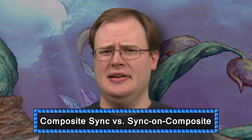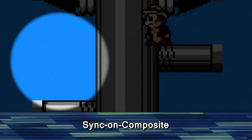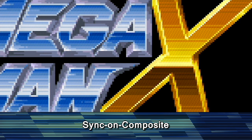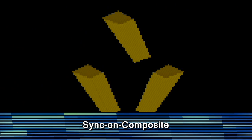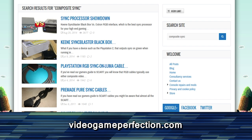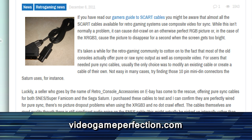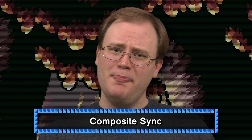So why use composite sync instead of sync on composite? Sync on composite, even though it is the SCART standard, can have artifacts introduced as the display or device receives and processes the signal. When using standard SCART cables on our equipment, we sometimes see checkerboard patterns on certain shades of various colors. Composite sync cables clean up the image quite nicely. Matt Buxton of Video Game Perfection tells us that C-Sync cables fix display issues with older XRGB scalers like the XRGB-2 or XRGB-3, but warns that a small number of SCART-equipped TVs might not accept the signal. While searching for composite sync cables, you might see them referred to by various names — C-Sync, RAW-Sync, Pure-Sync, Boosted-Sync — it's all the same thing.